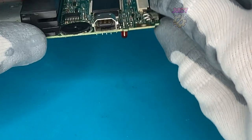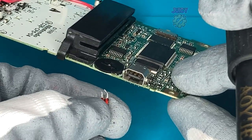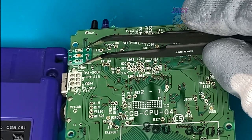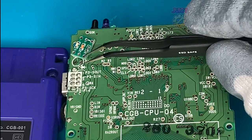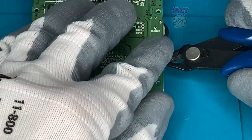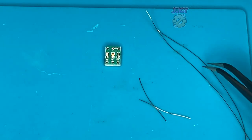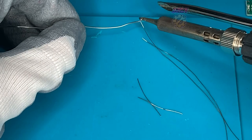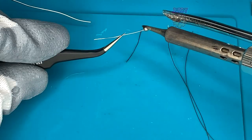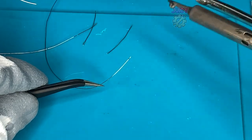Moving on to the Game Boy Color itself. Now that it's out, let's take out the original red LED - I'm just going to apply heat and pull. Now that's out, I can keep that for any future repairs. There is an orientation for this LED with one side being positive and one being negative. I was thinking of putting the board over here where the original LED was, but there's a pin in the way from the link connector, so I'm going to have to cut that off to make room for my little board. Now that's cut off, it fits nicely.